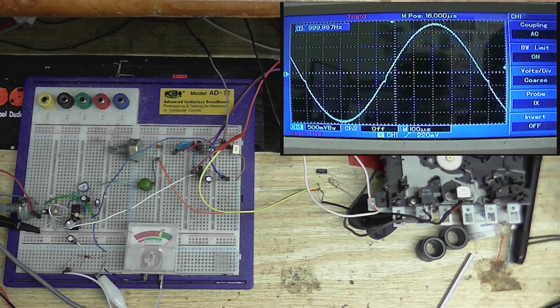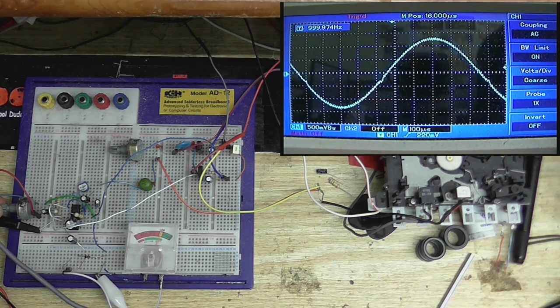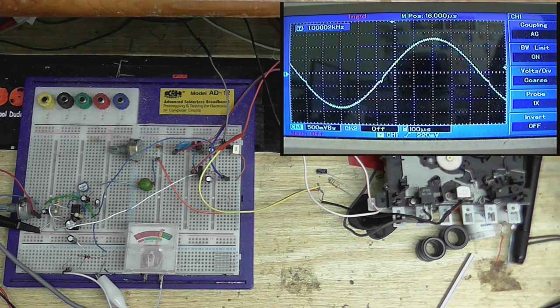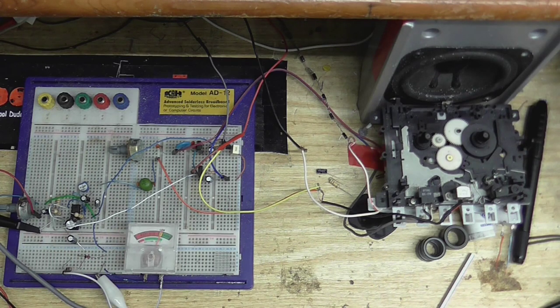And that is already pegging the meter, so I'll turn that down so it gets into the yellow there. That's right, smack bang in the middle of the yellow. And I can see a little bit of a kink on the scope there. Looks a bit like a Class AB amplifier that's not biased properly. That could be because of the chip that I'm using, because I'm not using it in the way that it was intended to be used. But I think that's good enough for this thing.